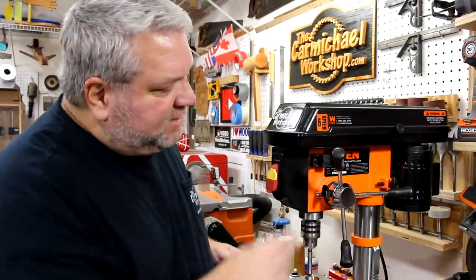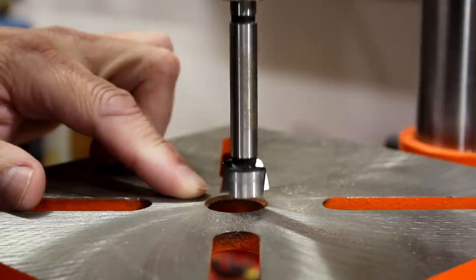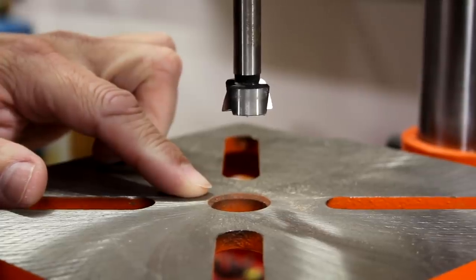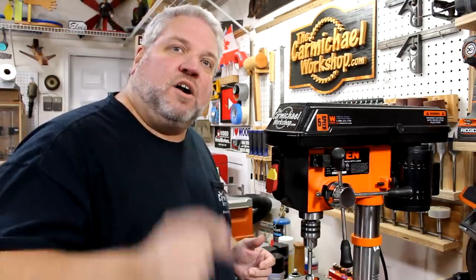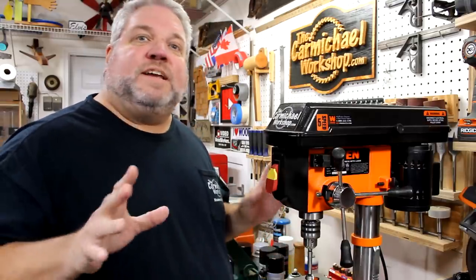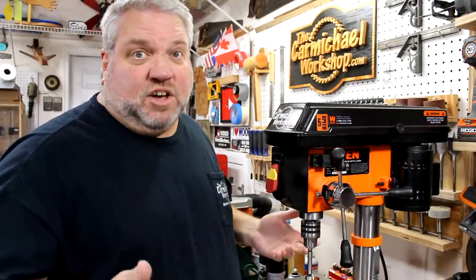Drill presses usually have a depth stop you can set to keep you from drilling all the way through the board. So you want to use that feature if you have it. If you're just using a regular drill and bit, you can accomplish the same thing by putting a stop collar on the bit. Either way, you want to make sure you drill all of your holes now before you assemble the enclosure, because it might be hard to get a drill in there later.